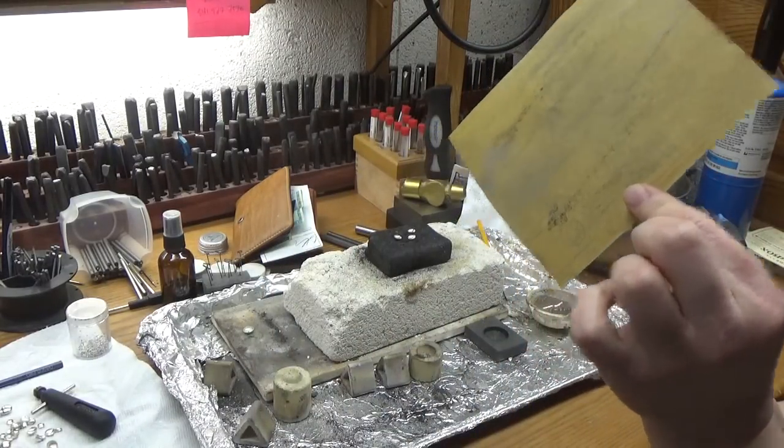I always start by going around the charcoal brick. As I'm doing this, I didn't bother with which piece was on top, whether the piece with the solder was on top or not, because it doesn't really matter. Right about now I'm starting to see it turn. I haven't got my flash yet, so I'm just going to back it... there is my flash. You want to make sure it goes all the way around. Sometimes even just a little bit will do it. Start around the charcoal brick so you can get that bottom piece heated up. There it goes — all the way around. And that's it.